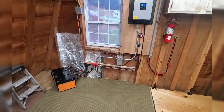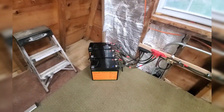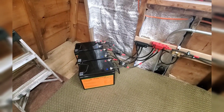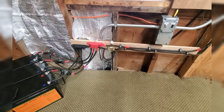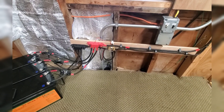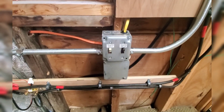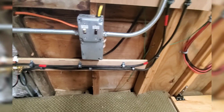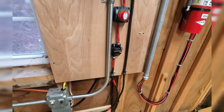I put one on the bus system and it worked good, so this time I went with a 24-volt system. I've got three 24-volt 100 amp-hour batteries, all with individual breakers onto a bus. The bus goes into a current meter that goes to our remote downstairs for our charge status. This is our 120-volt coming in and our output going out. They're switched so I can turn them on or off — that's our main breaker protecting the inverter.